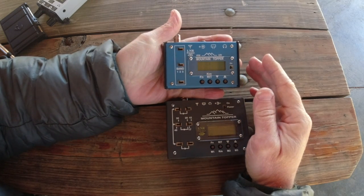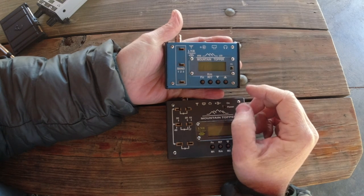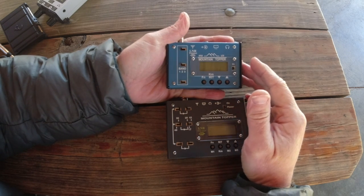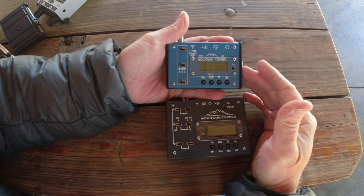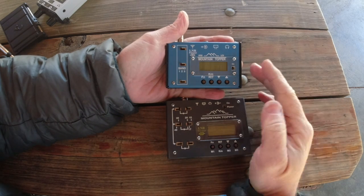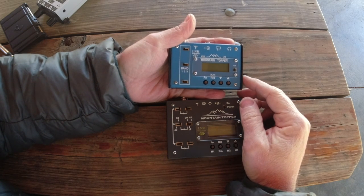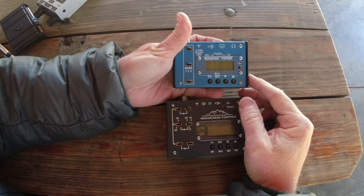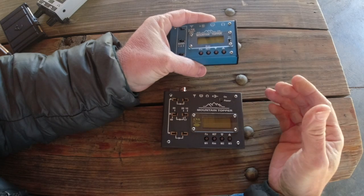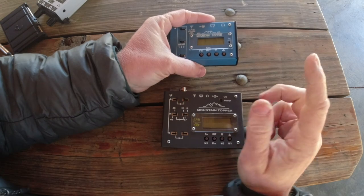If you're comfortable with the audio level, then you may not need this, but most of us get headphones that have an inline analog volume adjustment and use that. Also, I use a recorder to record a lot of my videos. Since I'm making videos, I'll record the audio into a digital audio recorder and then use the digital audio recorder's volume control in order to control the volume out of these radios. You can change the side tone level a little bit, and I think even the frequency on some of the newer radios. But for both of these, you have to really pull apart the radio, get inside, and change that with a little screwdriver on a little trimmer thing. The MTR-4B is the same way.